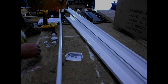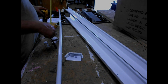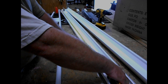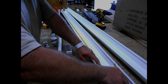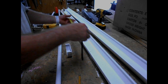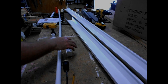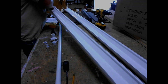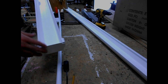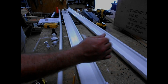To start, we're going to cut our two pieces of gutter. I measured the opening in the greenhouse at 70 inches, but with the end caps on I'm going to try 69 and three-quarter inches. We'll fit it before we glue anything together. There's our first piece with the ends on — I went and put it in the greenhouse and it fit just perfect.